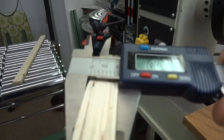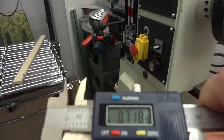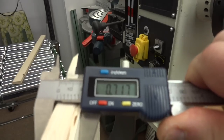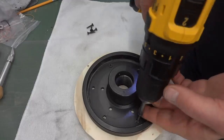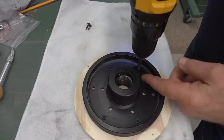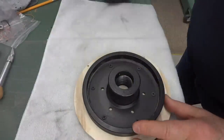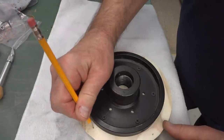It was flashing by there pretty fast, but every one of those measurements — there were about 16 of them — each one was seventy-one one-hundredths of an inch. That's pretty close; now it's within a hundredth of an inch. Even though this faceplate was ground precision flat, when they drilled the holes it seems like they did them at random, because there's really only one way that it can be joined back together again. So I'm just indexing it here so that the holes will line up properly.